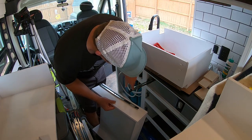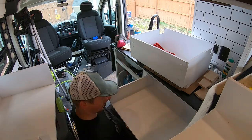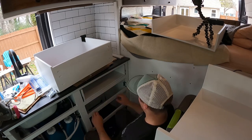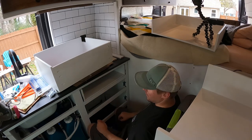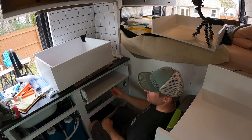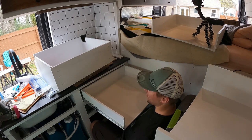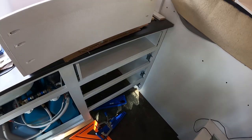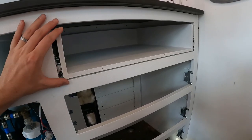The first couple of times it was very rough and it wasn't sliding nicely. As you can see now, it slides really nice. Remember on the back on those brackets we didn't drill them into the wall all the way. Now that I've opened and closed this a handful of times, it kind of evened itself out and we'll be able to screw into the wall in a couple of different places. These slides should be set perfectly. There's that drawer with the soft close — got a couple of other screws in the bracket there, so it should be good to go. We'll just have to figure out the front for it, but I'm going to move on to the next drawers and then we'll get the fronts together at the same time when they're all in.